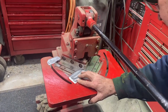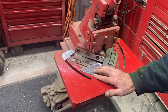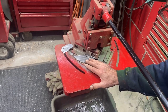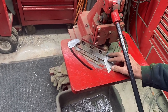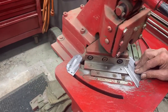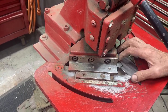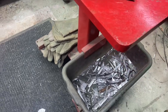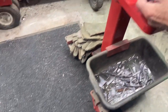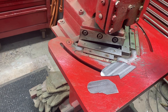Then I come back and get this curve. Now I'm going to come around here to the back of the mold board and take the biggest piece I can right there, and try to cut a couple little strips right there, and then a couple right here, and then one more right there. So those are the two rough cuts - that's how this little nibbler, or six-inch hand shear, works.